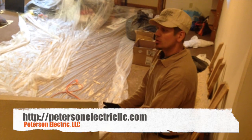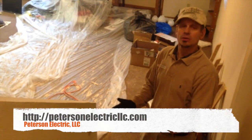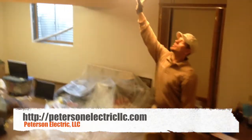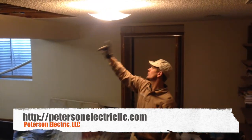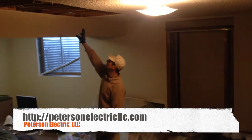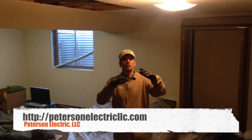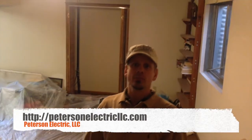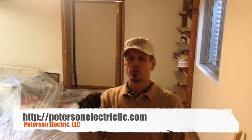As you can see in a living room like this, it is possible that circuits could share there, and it's usually in your switches. But one other place it could happen is down in the basement. In this light box I found a power in and a power out, then a switch loop, and then a second switch leg going to another light. Sometimes people will mix their neutrals behind the lights. You always want to go into the basement and look for odd areas of splices — that might give you a clue too. Go through your house, turn off all the circuits, and only keep on the one circuit you're tracing in order to figure out where it jumps.